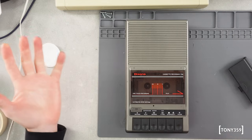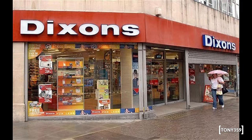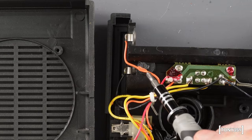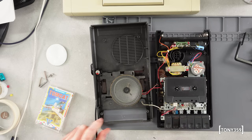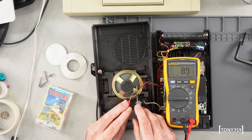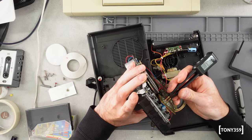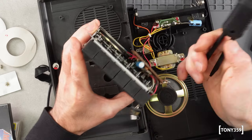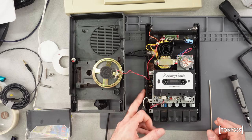The cassette player is a standard Dixons unit — they used to be an electronics store chain here in the UK which closed in 2014. It's nothing special, though it's in great shape. I took a look inside, found a squashed cable probably from manufacturing, then plugged the mains power — surprisingly it works and the belt seems to be okay. But there is no sound output, not even the expected hiss in the background. The speaker seems okay. I took out the whole deck but didn't find anything obvious. The PCB is installed in a way which makes troubleshooting quite complicated, and I don't think I'll try to fix this since nobody is going to use it when modern alternatives exist. I'll leave it to my friend Peders in case he wants to revive it.